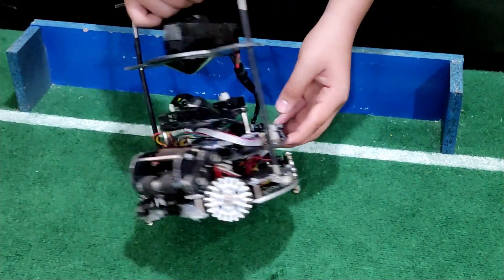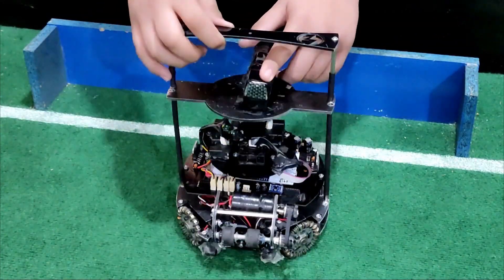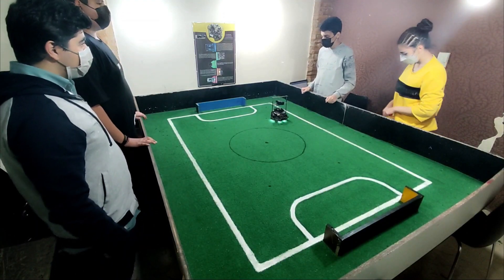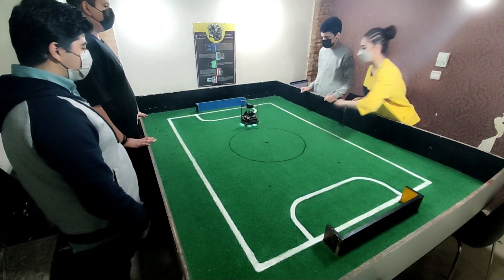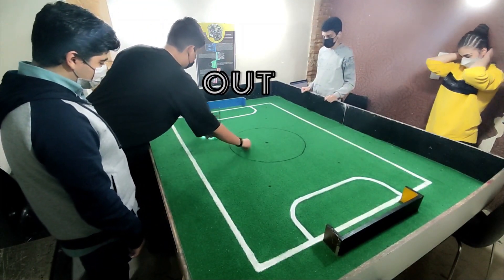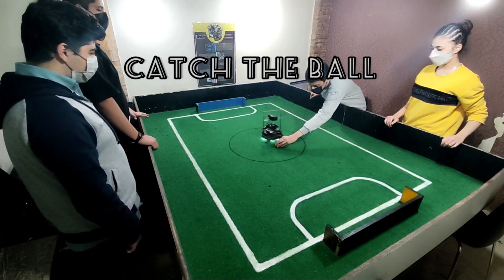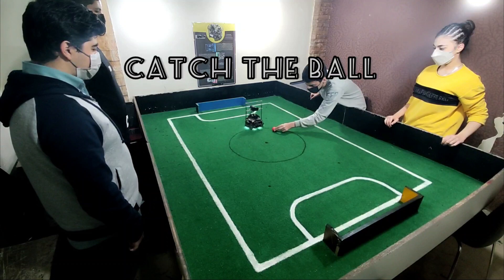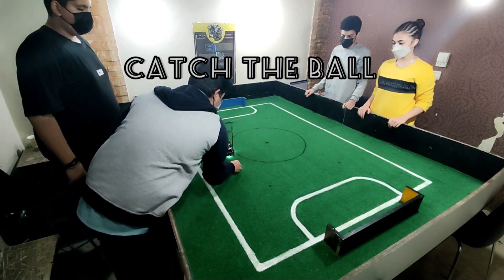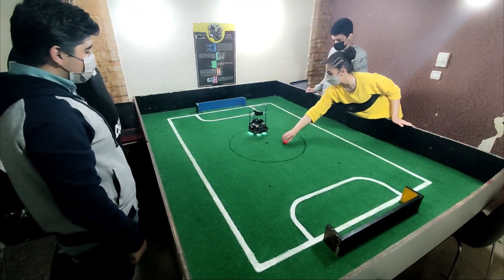The ball-capturing zone sensors are on both sides. The motors are arranged 2v2 in front of each other. The battery compartment is between the handle and the mirror. We use Pixicam to find the ball and we divide the circle around the robot into 16 parts. By adjusting the motor speeds, the robot goes behind the ball. When the robot catches the ball and the ball-capturing zone detects it, we turn on the spin and increase motor speed to move toward the opponent's goal. We use LDRs and sharp sensors to detect the goalkeeper's area and playing field.